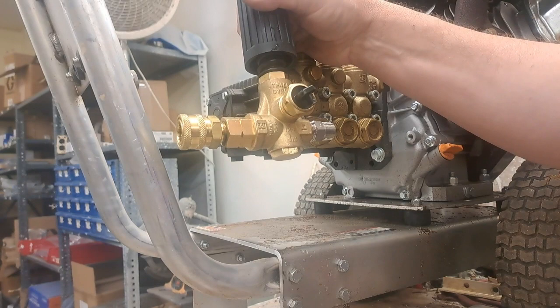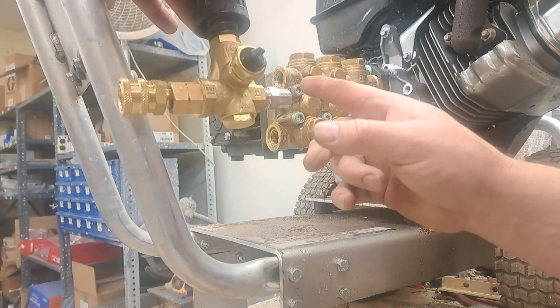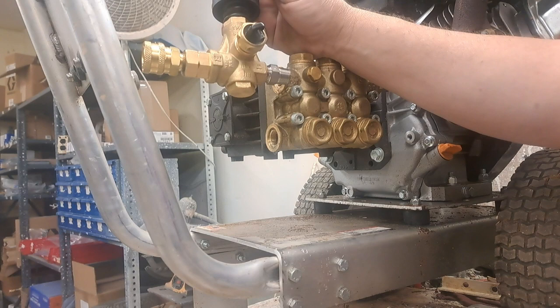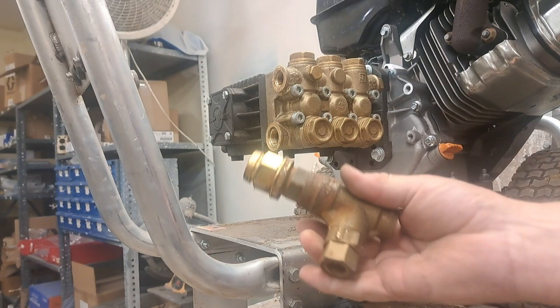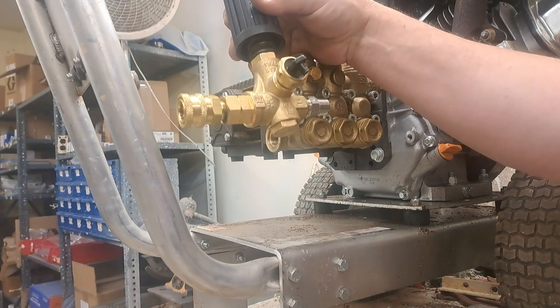You can actually set this up remotely, further away from the machine. So if you've got a trailer setup, you can move it wherever you want. The only attachment to the pump on the unloader itself is right here — you can have any high-pressure setup up to six or seven feet away, but it has to be a high-pressure connection. Remote unloaders don't all look the same; they come in all different shapes and sizes, and you can contact different manufacturers about options. But they all work on the same principle.